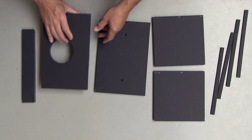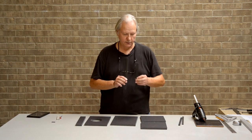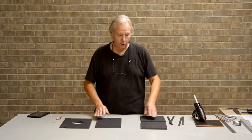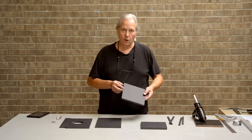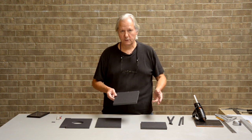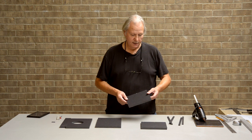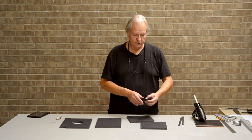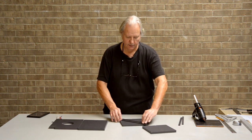The first thing we need to do is install some guides for our mirror that's going to go in the box. The reason I'm not gluing the mirror into the box is because if anything went wrong — you broke the piece of glass or you want to change out to a different reflectivity mirror — you'd have a bear of a time getting it out. So I'm going to put some little guides or tracks that are going to go down from one end to the other.